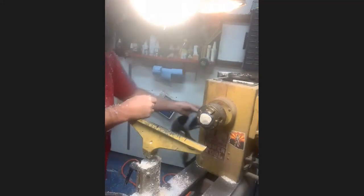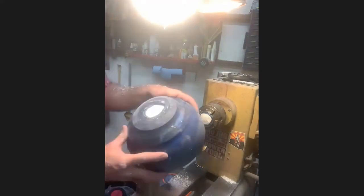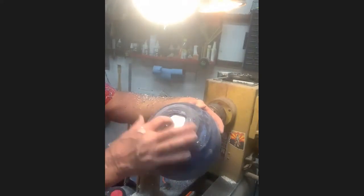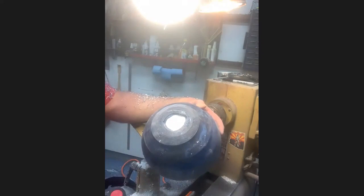Well, oh, God. It's all at work. Hate it when that happens. But you know, we would know what not to do unless we looked at this. Right. Sounds like it's kind of hit and miss with those. Yes. Turn it around and redo your recess there and rechuck it. That's what I was thinking. And make a mortise instead of a tenon. Right. And then don't expand it so tight.